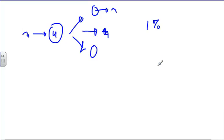Some of them are delayed less than a second. Some are delayed 1 to 2 seconds. Some are delayed up to 10 minutes. In our approximation of how a nuclear power plant works, we've split them up into six different groups. The reason a civilian nuclear power plant can't blow up as a bomb is because we never get prompt critical. We never get critical enough so that delayed neutrons don't matter. The delayed neutrons are what we're controlling the reactor power with. In a nuclear weapon, the delayed neutrons won't make any difference. The weapon has already blown up before the first delayed neutron shows up, because it happens in 10 to the minus 11th seconds.